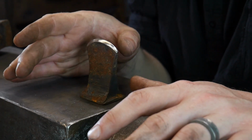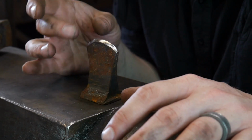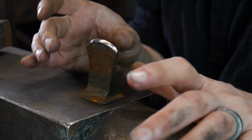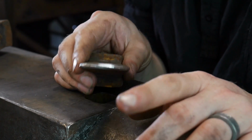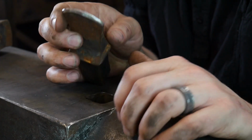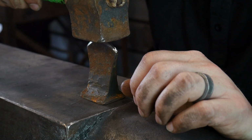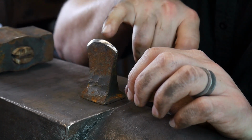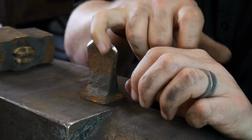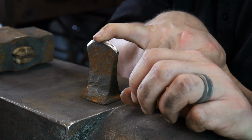What this does is two things. One, this stops me from constantly trying to resharpen a tool that is only going to lose its temper anyhow after a period of time. Two, it stops rollover. It stops things from just rolling over from a missed hammer blow. When you hit like this on top, it has a tendency to glance or roll like that. If you accidentally hit the tool, you'll roll over an edge and then you've got to grind it back to get that roll out, okay?